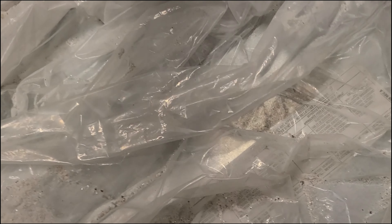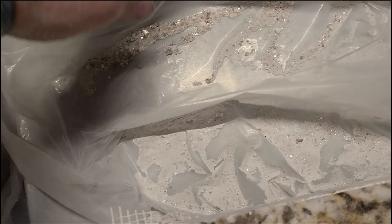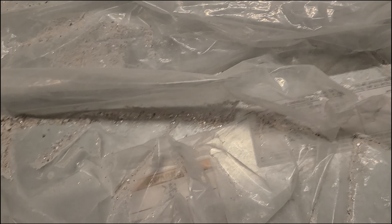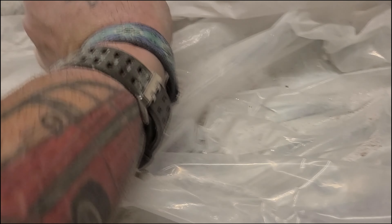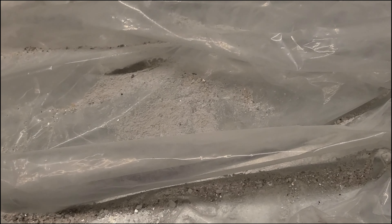I started pulling the cooktop bag off but wanted you guys to see what they're for — they catch all the dust and stuff and keep it from getting down in the cabinets and on the rollers for the drawers. If you tape it around real good it does a great job of keeping it contained, as long as the guy running your vacuum doesn't grab it and rip it apart. I totally recommend them — they're not that expensive. You can get them from Braxton and Bragg. Buy yourself some cooktop bags and put them in there to save you and your customers a world of stress.